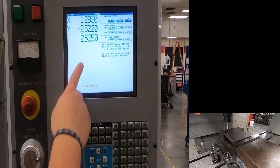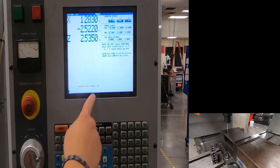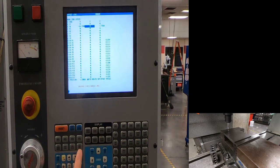Z is blinking — we want to be moving forwards and backwards, so go into Y. Make sure increments are low since we're already close. Put your whole hand on the hand wheel, not just fingers, and come into the part slowly. It looks pretty straight, but wait until it breaks over — it does break over. Same procedure: origin out Y, come up in Z until we're over the top of the part, go back to Y, and move over half the diameter of the edge finder — 100 thousandths.